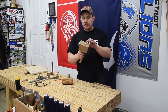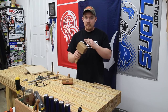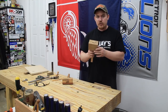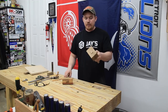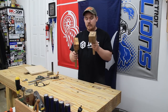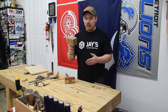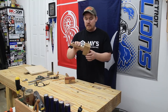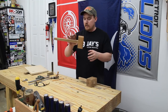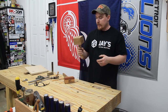This mallet is done minus the chamfer on all of the edges. I'm going to use about a one-eighth of an inch chamfer on all edges just to break them off a little bit, then maybe round them over slightly with some sandpaper. I don't want a full round over because I like the look of the straight lines this style mallet has. This is a small mallet — the head is a little bit beefier and it's oak. This is exactly what I was looking for: all of the weight in the head of the mallet. It's not balanced at all — all the weight is in the business end. I want all of the weight and momentum to be in the mallet head, and I think I've got it with this one.